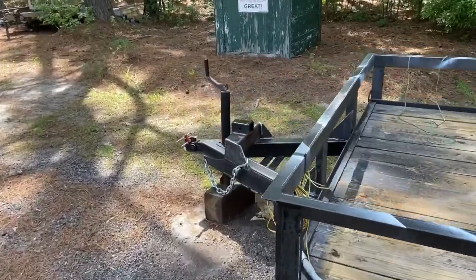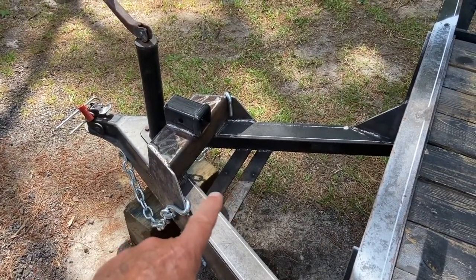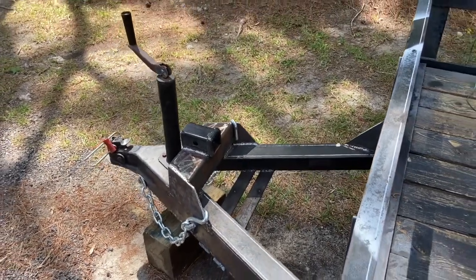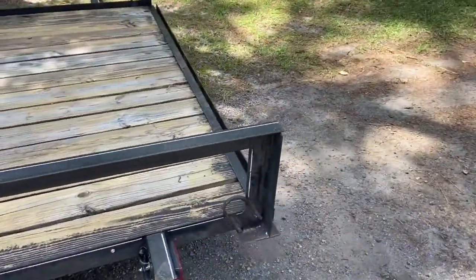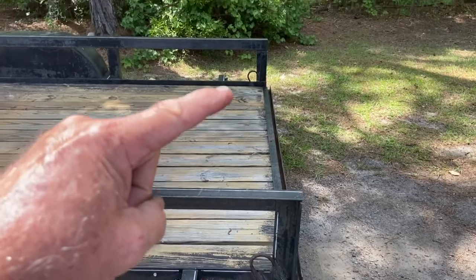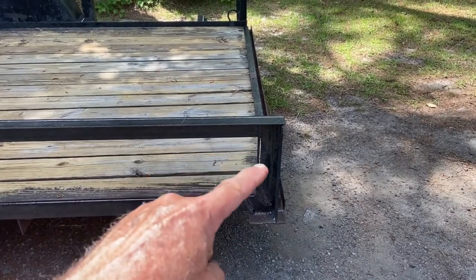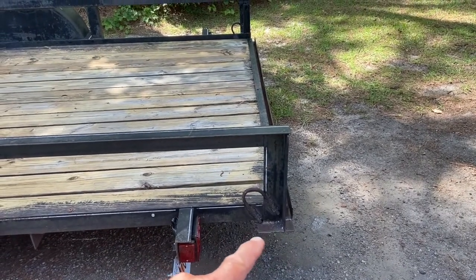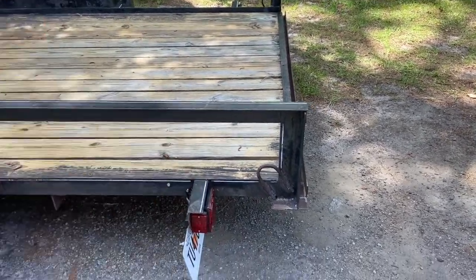And one of the things I added, those 2 1/4-inch, 2-inch wide strips down below, and there's a battery box for the breakaway switch that automatically puts the brakes on should the trailer ever come loose. On the back, I've also, on both sides, added a tie down, and there's another one over there. There wasn't any on here, and I've also reinforced this angle iron beam coming up on both sides with a 5x5 by 1/4-inch plate underneath to give it some strength. They weren't very strong, and they were actually bent in a little bit.